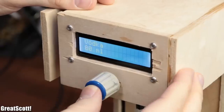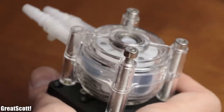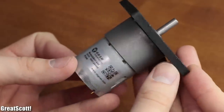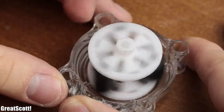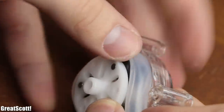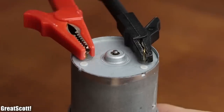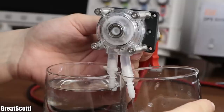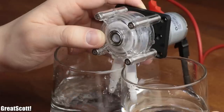While I've talked about most of those components in previous videos, I never got the chance to showcase peristaltic pumps. I got mine from eBay, and if we remove the four mounting screws that hold the plastic construction to the motor, we can see we're basically dealing with a 12V DC motor. The plastic structure on top consists of a rotor with three rollers which, after inserting a flexible silicone tube and reattaching the construction, compresses the silicone tube. This deformation creates pressure which forces liquid inside the tube to move forwards — and if we change the polarity of the DC motor, the liquid flows backwards.